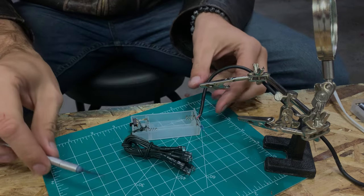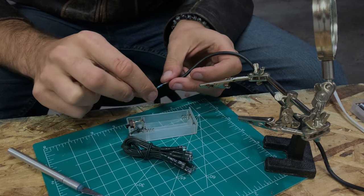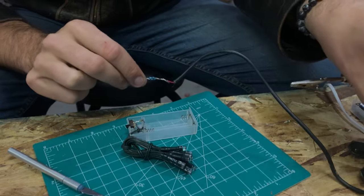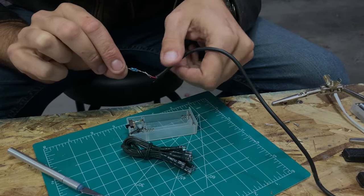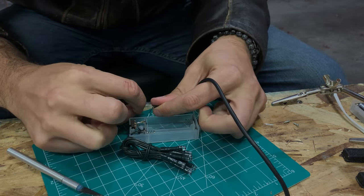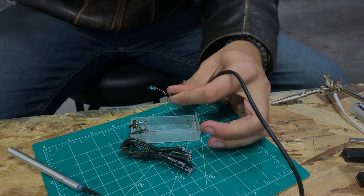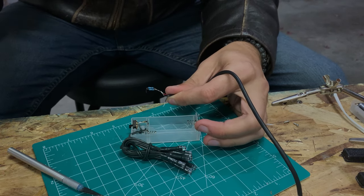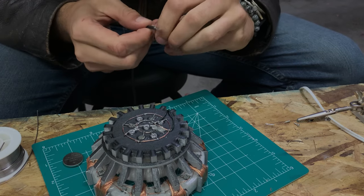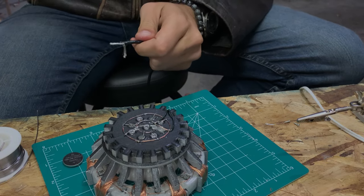The LED strips came with a switch and a battery pack, so I threw a switch at the beginning of the circuit with a couple of resistors. In order to decrease the 5 volts that will be coming from the USB, 2 10 ohm resistors were soldered in parallel side by side to decrease the resistance down to 5 ohms that I ended up calculating we would need. A spare USB male plug was scrapped from an old phone, brought out, measured, and stripped.